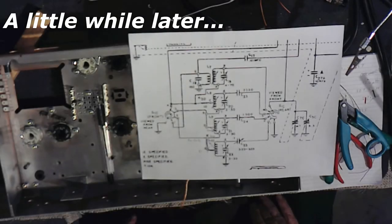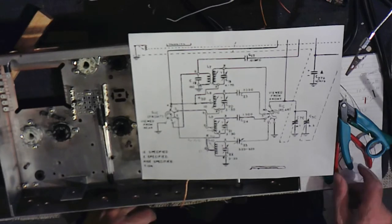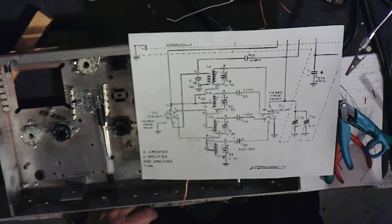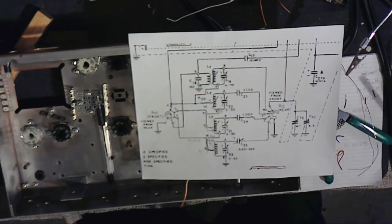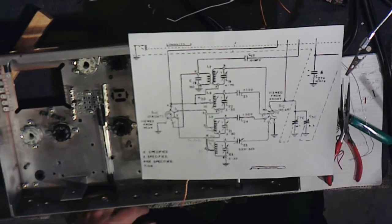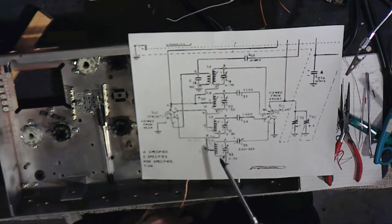Well, it does pay to have a parts receiver. There was some revision, and this is a Mark 1D, and it's probably wired all the radios to this Mark 1D, which works very, very well. Essentially, they have bypassed this little piece of band B, this small center tap on L9.